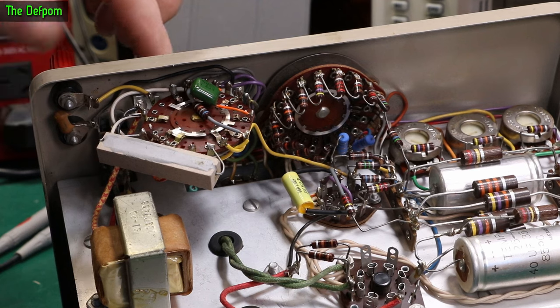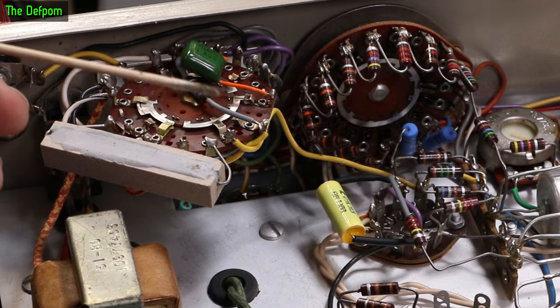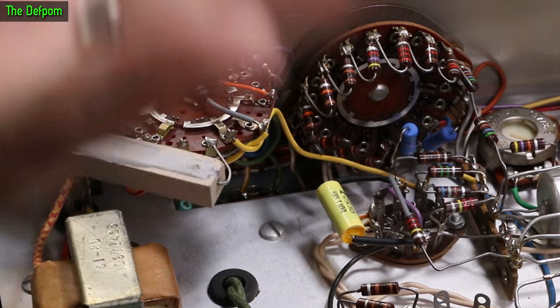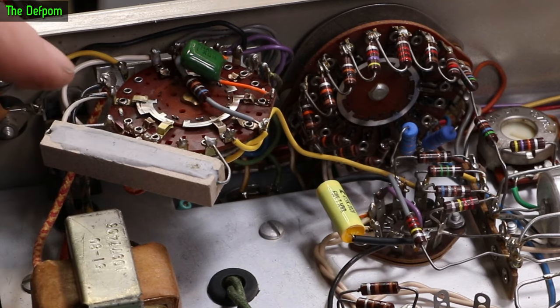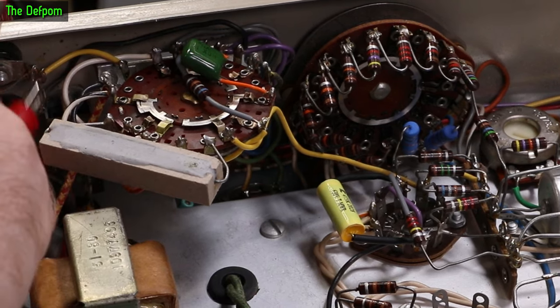Here's the back of the switch, which does leakage in that position, discharge in that position, and bridge in that position. I've cleaned the switches up — it's all nice and shiny. I've used little cotton bud sticks which are really quite good — they don't leave much behind and are really good at scrubbing. I've also used a fiberglass brush on the ones I can access. You can get into the actual plates but not the fingers themselves. I've been looking at which switch contact is giving me trouble, so I hooked up to each connection currently made in the bridge position and measured through the switch to confirm the contacts. They're all good apart from one — and that's all it takes. So I'm going to hook this up now — these two here are actually the input side.